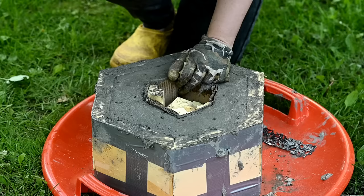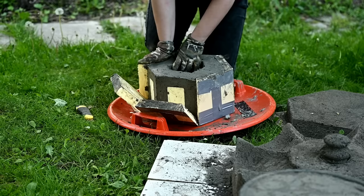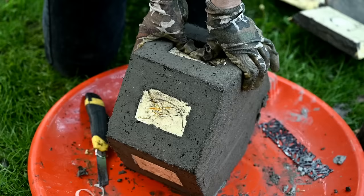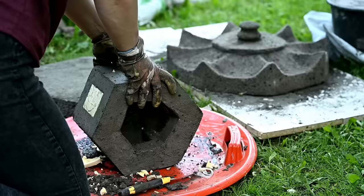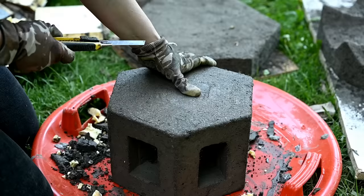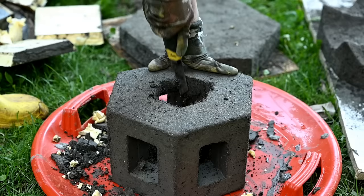Now for the main body with windows. I'm disassembling the mold and first I'm breaking off the side walls. It's a bit difficult to remove the pieces from the windows — the mixture expands slightly when cured and the foam sticks inside the windows tightly, so I'm breaking them out piece by piece. Of course the mixture has flowed to the bottom and into the places where the windows will be, so you'll have to break a thin layer of the cement mixture. Fortunately, this is very easy to do and I'm just trimming the edge with a box knife.